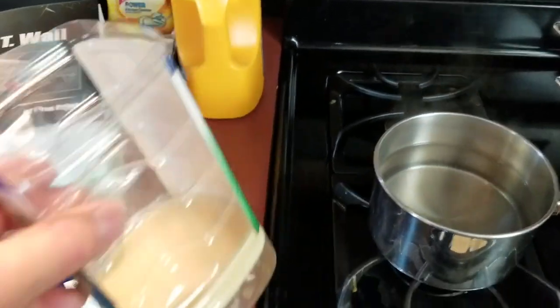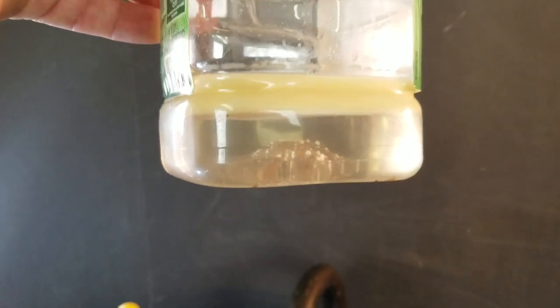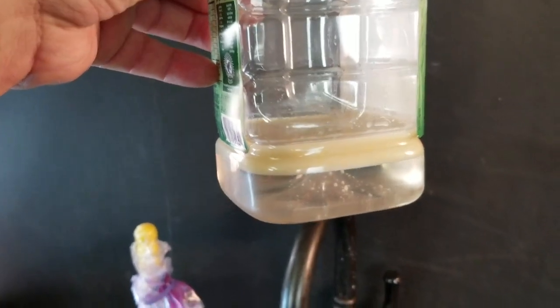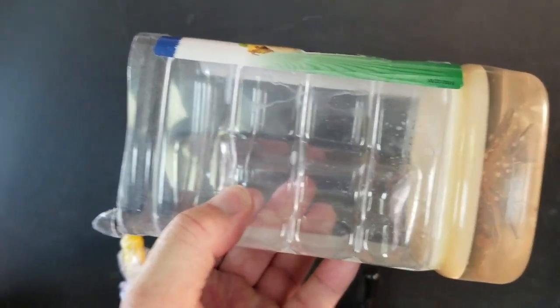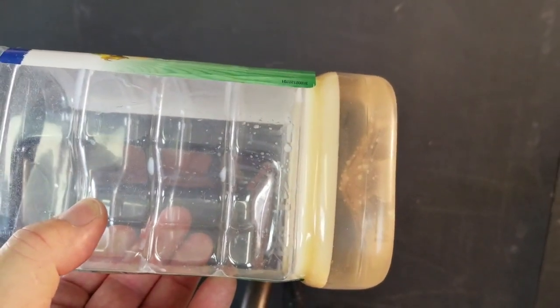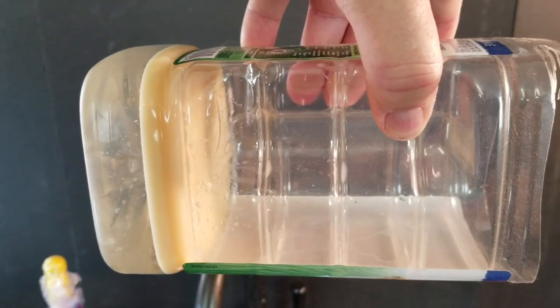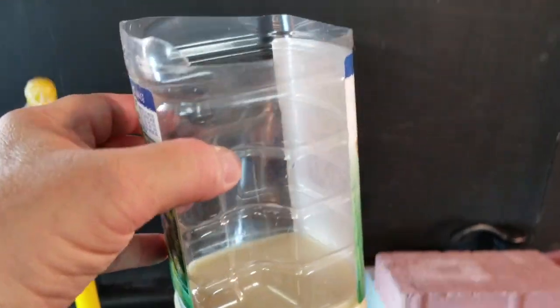Let me show you right here. Even though we don't have our clog anymore, I did this demonstration. I blacked out this window because the light was conflicting. But you can see — this is a little bit of grease from a hamburger me and Gus had last night. You can see that's water underneath. I always put a little water in the bottom so I don't melt it out. And you can see how that grease could clog your pipe. That grease is just holding like a rock. You can run a snake through there and poke a hole in it, but it still won't discharge.